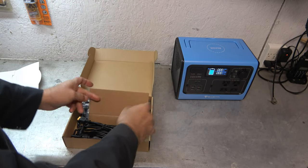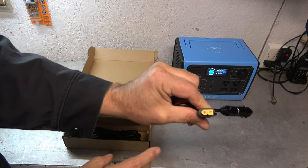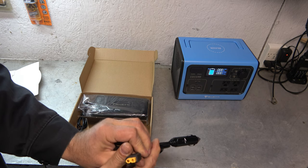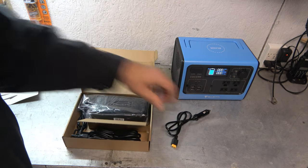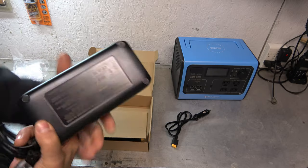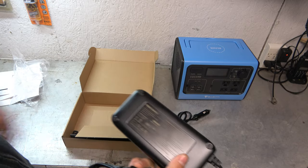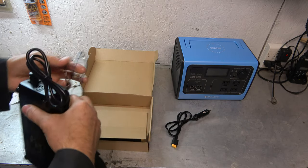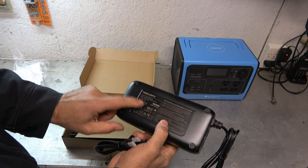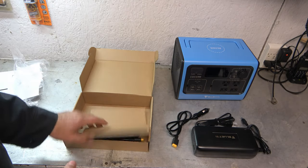Let's open this up and see what else we got. Here is our 12 volt charger, and there's the solar-direct connector end — so if you want charging from solar direct, that's a whole lot better than the barrel style plug that most of these units come with. Here is the other half of our charger, and here's the 120 volt charger. That is significant — look at that, it even has its own cooling fan. So this must be a pretty fast charger. Output is 25 volts at 8 amps, so we're talking about an 8 amp charger.